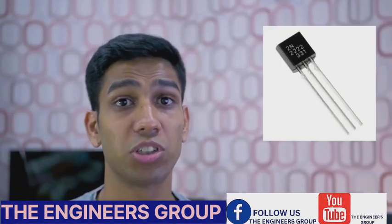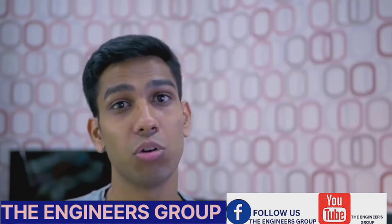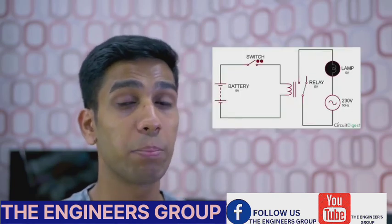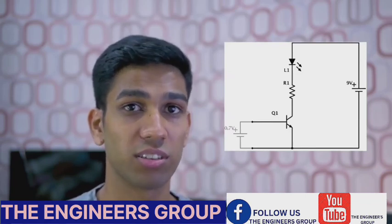A few videos ago, I talked about how transistors revolutionized electronics by their ability to switch on and off huge electrical loads without any moving parts, just using a small electrical current. Relays can do the exact same thing — they do the same job — but how they do it is different. A relay will isolate the input voltage that turns the relay on from the load, while a transistor needs to sink the input voltage that turns the transistor on through the load. I'll explain it more in depth as the video progresses.